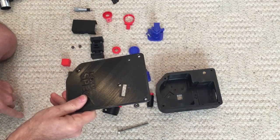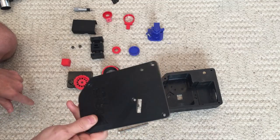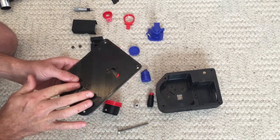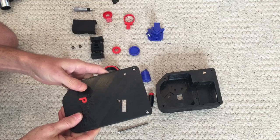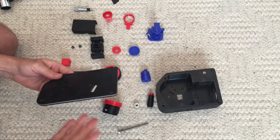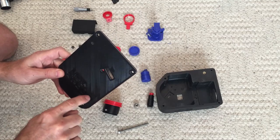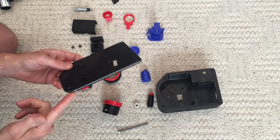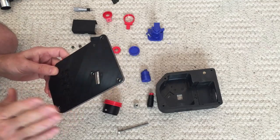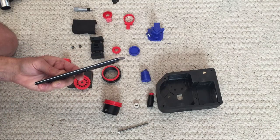The cover - this is actually the second one I printed, taking about 10 to 12 hours. The design has an inlay where you can print little letters and snap and glue them in. I couldn't get that to work, so I reprinted it. My plan was to change the filament color to white for the last three layers of the lettering, then continue printing in black. Unfortunately in Cura I specified the wrong layers.